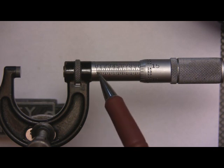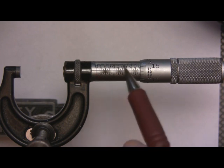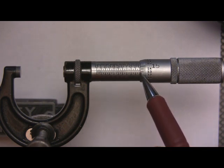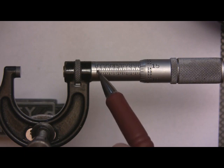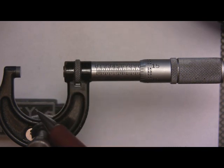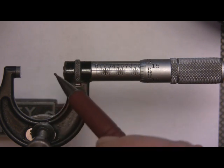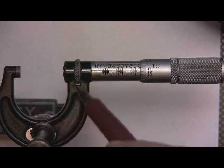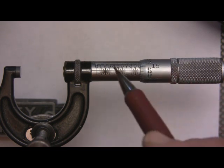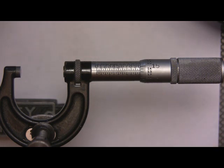Let's start by dividing an inch, because that's what this is. Any set of micrometers — even 99-to-100 inch mics — only measure one inch total: the distance between the anvils. The small end when shut would be 99 inches, and fully open adds one more inch. The thimble and scale always read that one-inch span, so we're going to divide an inch by tens: 100, 200, 300, 400, and so on up to zero.